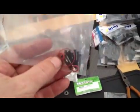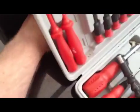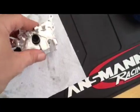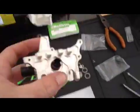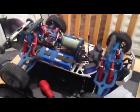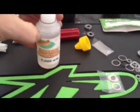I bought new rubber seals to go on them, and I'm going to fill these up with 5000-weight oil in the rear and 3000-weight oil in the front. This one I've just put together is the rear. I'm going to stack that on there — as you can see it closes up quite nicely, everything's sealed in nice. All I've got to do is fill up these discs with the oil through these bolt holes and do it up. I've done all these up now and filled with 5000-weight oil.